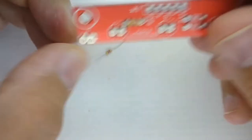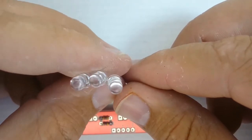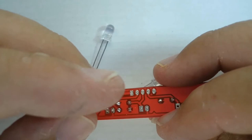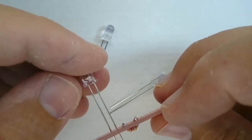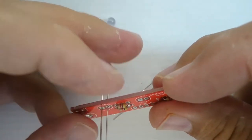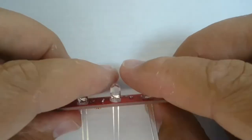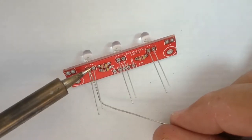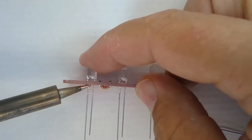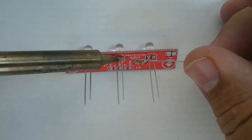Place the 4.7 kohm resistors inside the outlines marked 4K7 and solder them in place. Now locate the phototransistors — they have a small black square chip of silicon inside the clear casing. Place them on the board from the side opposite the silkscreen, with the longer leg through the hole in the square pad. Make sure the shorter leg comes out through the hole nearest the flat side in the circular markings on the silkscreen. Again, be sure to only solder one leg of each phototransistor, then check alignment and solder the other legs once satisfied everything is set up properly.